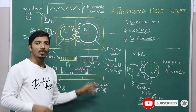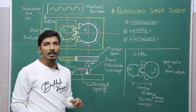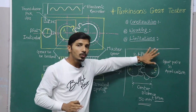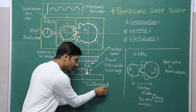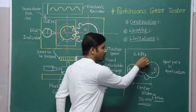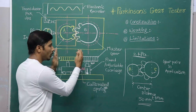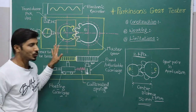The calibrated spring is used to maintain the pressure between the two gears. When gears are used in any application, they transfer forces or pressure, so there is a pressure present in the application. To simulate that condition, we use the calibrated spring here. What does 'calibrated' mean? If the pressure in the real application is 2 kPa, we calibrate the spring with that same pressure, so the spring exerts and maintains the same pressure — meaning we are simulating the practical conditions on this instrument.